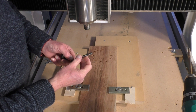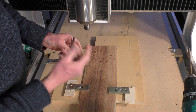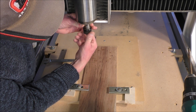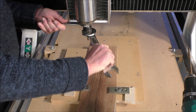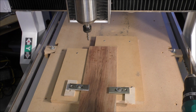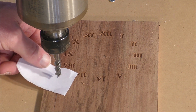So this is a three-flute, eight-millimeter extended end mill. We're going to put it in the collet — you can put it in quite a length because we don't want the full length sticking out. I do have a Z-height tool setter, but not everybody has one, so I prefer to show how to do this the easy way with a bit of paper.